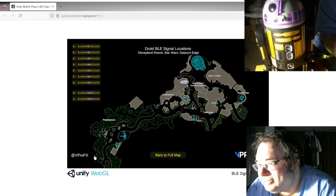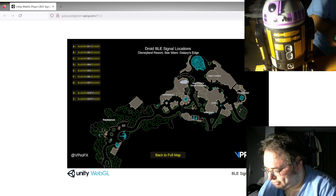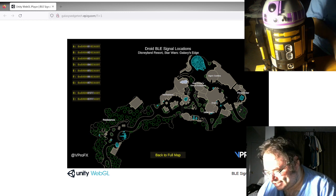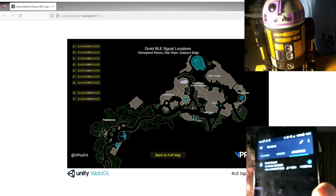Okay, here's where he talks about the app. Alright — that's what I missed: 0183, Disney's manufacturer code. So let me come back to our map and try this again. Add record, manufacturer 0183, and I'll copy that hex back in. Now it's letting me hit OK. We will turn the signal on. I have just put in the Droid Depot signal, put in the data, turned it on.